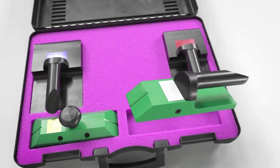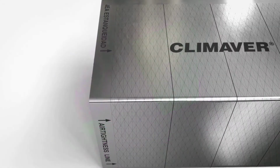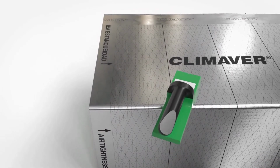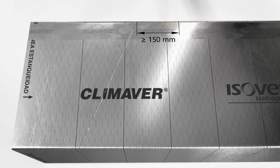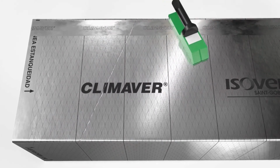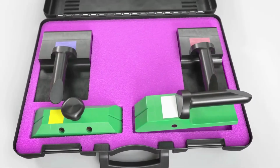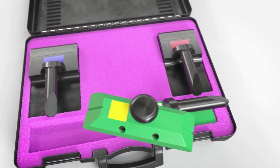The first cut is made with the white marked cutting tool with a straight 90 degrees blade. It starts at a minimum distance of 200 mm from the duct opening and follows the 22.5 degrees marking. The second cut is made at a distance of at least 150 mm at the opposite angle. Then the duct is rotated once by 90 degrees. The following cuts are made with the tool marked in yellow.